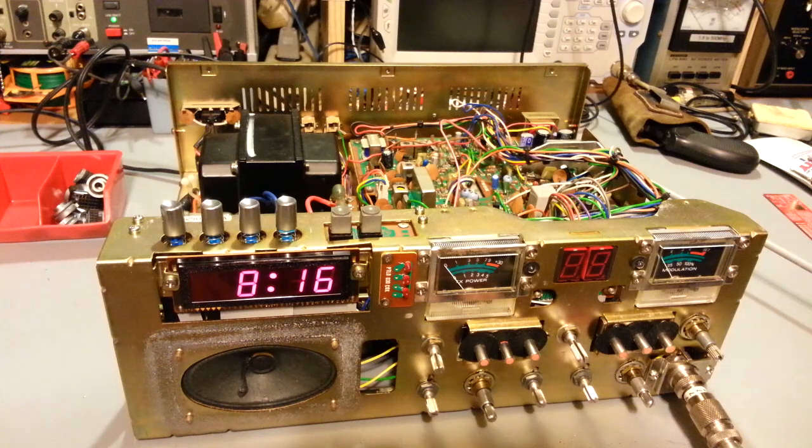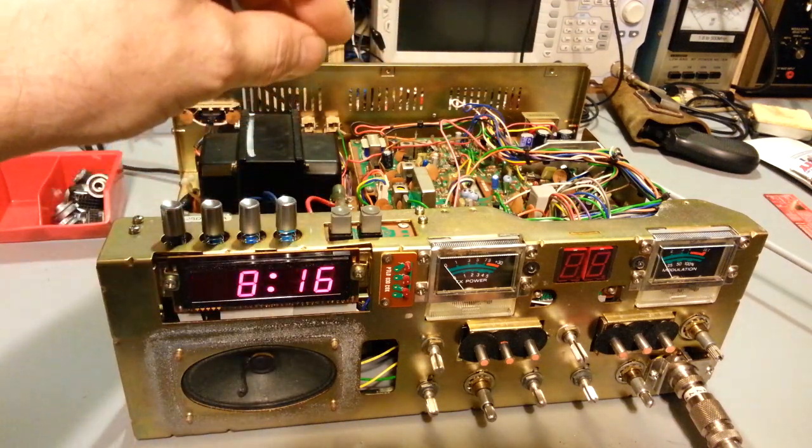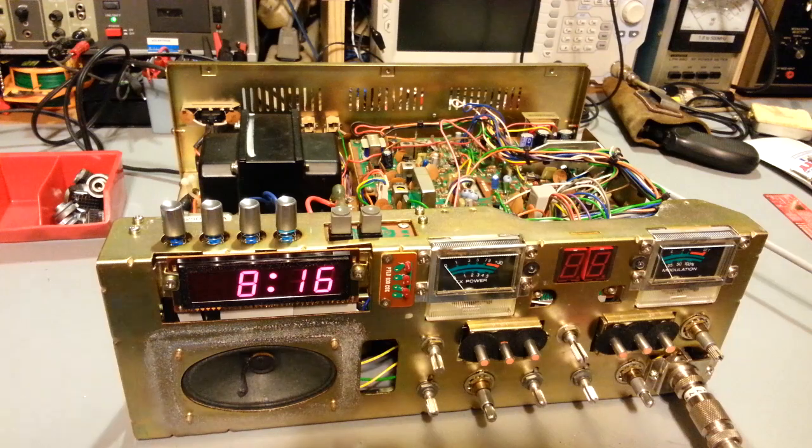Next time you see this, I'll show you the damage from the corrosion on the bottom side when it comes time to take that capacitor out and clean up the traces. I'm not going to do a whole video on that — I've done trace repair before — but I will show what it looks like, and once I get done epoxy overcoating it again, you can actually see the befores and afters.